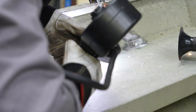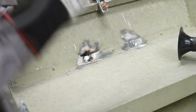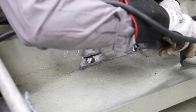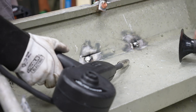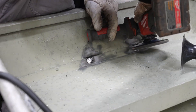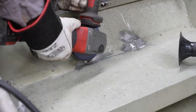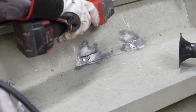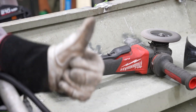I think this base hull material was 16 gauge or 18 gauge, or even thinner. The last thing to do was to weld the handle on the front, which had these aluminum rivets — I basically plug welded these and had a little bit of a weird weld there, it was a little bit hard to get in. But once I ground it, all of the welding that I had to do was done, and I could hand this over to Lewis to try to finish it up and continue to clean up my messy work.